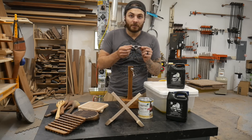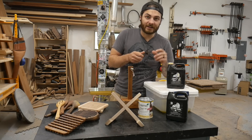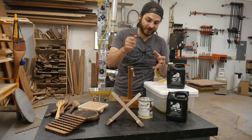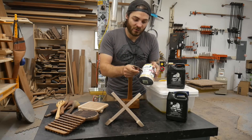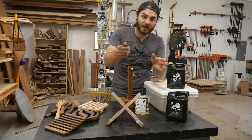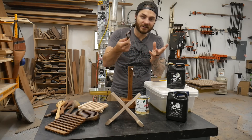For the book buddies I would not recommend oil products like that — after some research I saw that people who make these do not recommend using an oil finish, as it will probably leach into the book pages. The furniture finish would be fine because it dries and hardens. So what I did is just sprayed a couple coats of poly on them — just put a glove on, sprayed each side, and they're good to go.